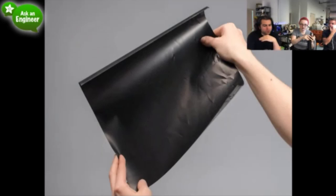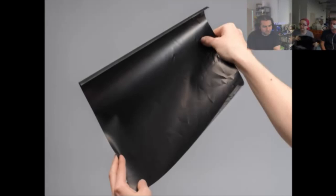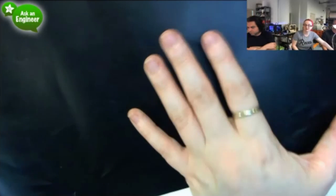This is my favorite product of the week — Velostat. Adafruit's official color is black, all our packaging is moving to black, all my clothing is black, so now we're just going to sell sheets of black. Velostat is a conductive plastic — it feels like a really heavy garbage bag but it's not. It's this conductive black material, and what's really cool about it is it's pressure sensitive. As the pressure increases, the resistance decreases. It's only a couple dollars for a fairly large sheet. It's very easy to cut, you can fold it — although that will change the resistance. You can heat seal it, and you can clip to it very easily. You can't solder it of course, it's plastic.